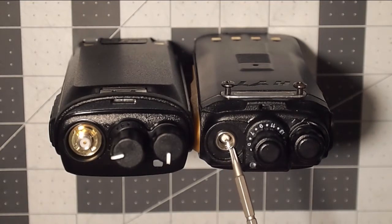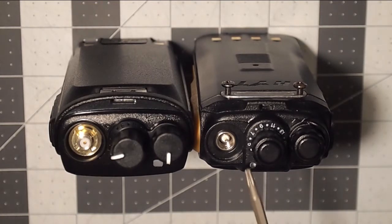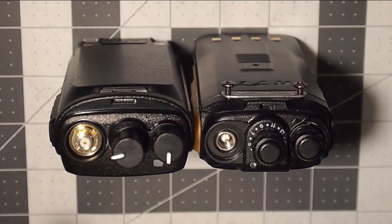This is similar to what Baofeng radios have. I will quite often get an antenna order and the buyer will remark they need an SMA male for a Baofeng. I'll point out to them that they're probably mistaken — they actually need an SMA female antenna, which is what that looks like, and it screws into there.